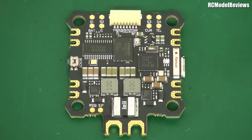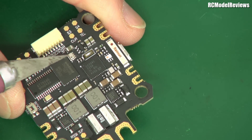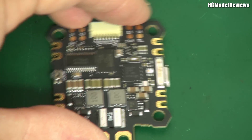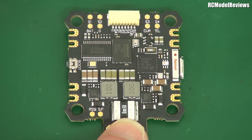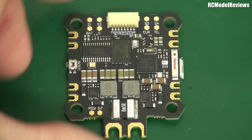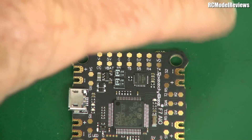So what do we have here? It's got lots of smoothing caps — that's pretty good. Do I see a barometer? Let me have a look. Yes — that little thing here with the hole is a barometer. So it's got a barometer; you could use this in fixed wing if you wanted to use iNav or something like that, but obviously mini quads are going to be the most obvious use. We've got power in, a nice beefy shunt, ESC connections along the side, and obviously an OSD and USB — lots and lots of connectors.